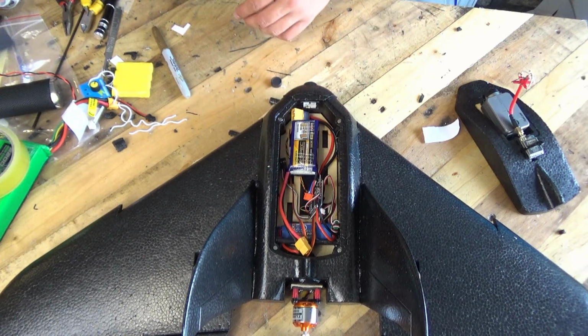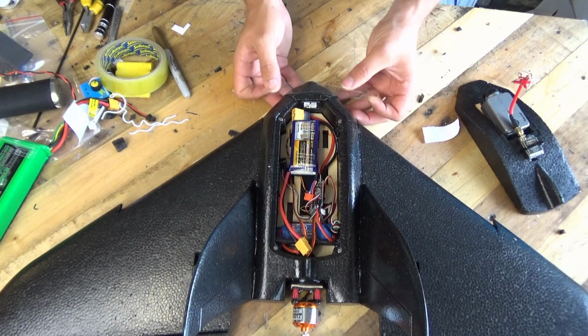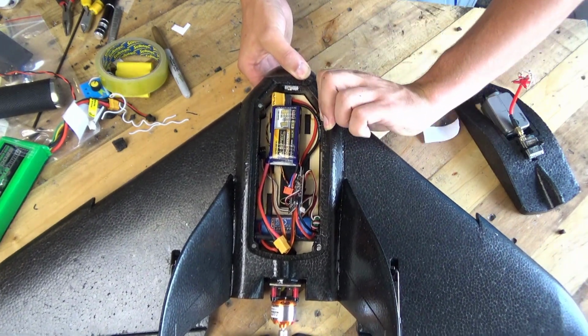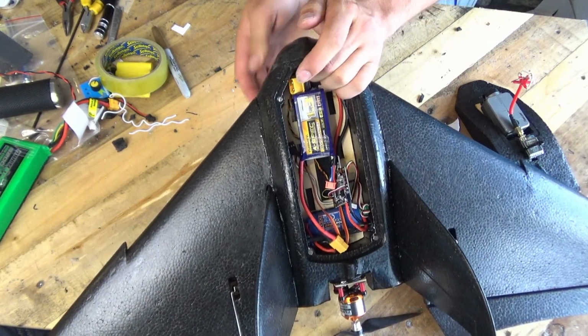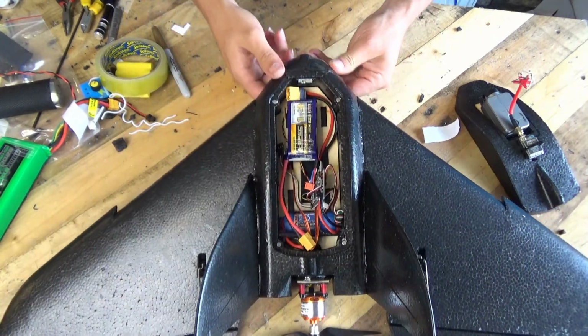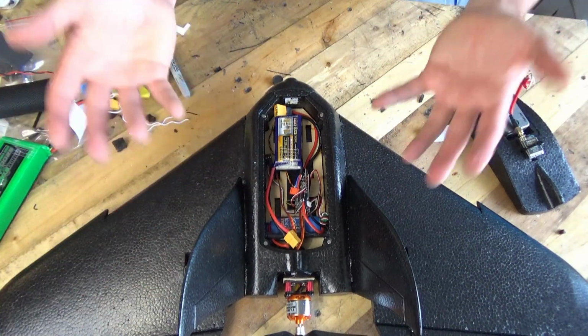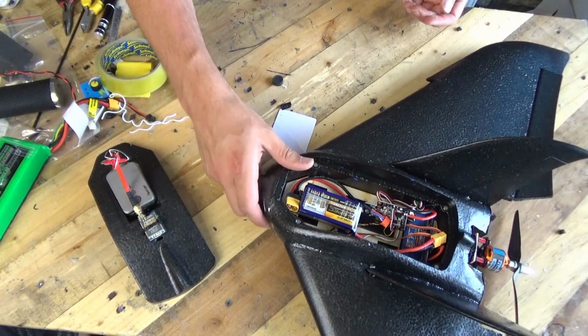And then all I've done in the middle bit is just put a bit of Velcro down. So with that said, I'm going to stick a bit of tape up over the top to make sure that camera holds down. Another little benefit of using the HUB OSD board is that it will provide filtered power for both the video transmitter and the FPV camera as well. So definite bonus for using that, and of course you get the on-screen display as well. I will do a video of that sooner or later. I've got a couple of them there. They work really well, like in the hardcore wings, which I don't want iNav in, but I would like to know what's going on. So that's the camera just taped in.